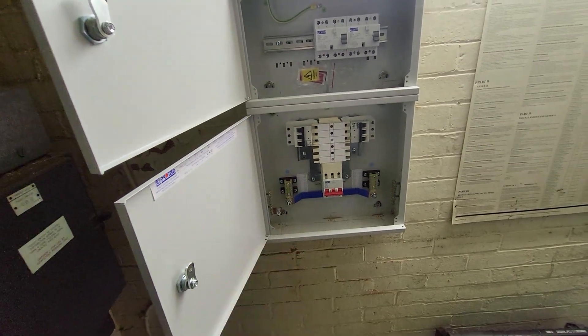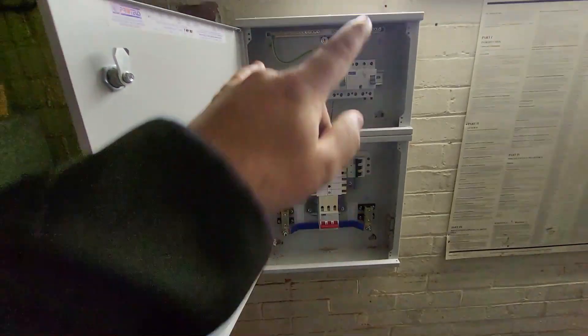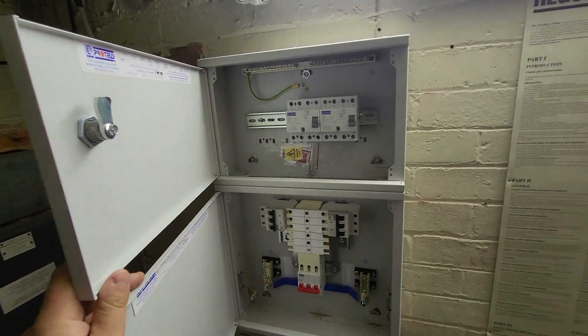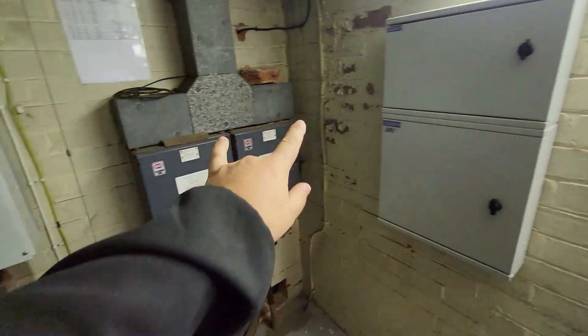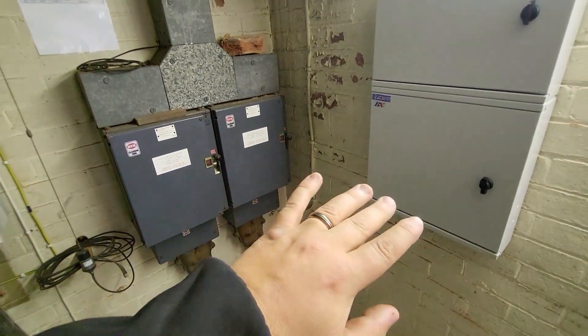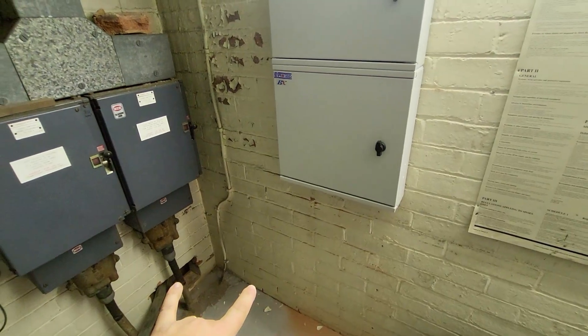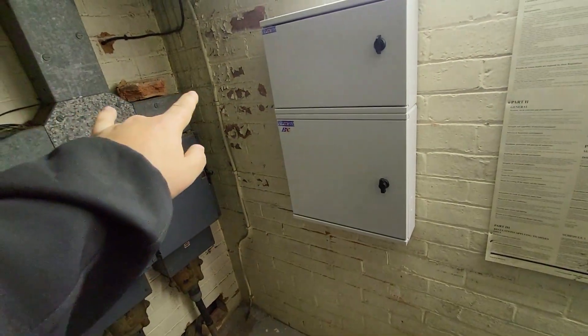If you put an SPD into your EV board that way, we're going to drop one in along the top here — we'll show you that when we come to wire it all out. There's plenty of room for us to work on that, and anybody who needs to get into this switchgear has lots of room to come and work on it. We're not obstructing anything. We're going to drop a little bit of tray across and down there, and also down here where we can pick up with the existing trunking, which is actually pretty empty — not a lot in there, which is nice.